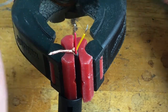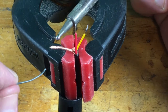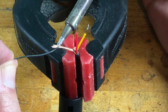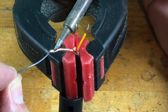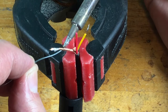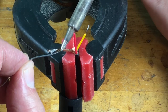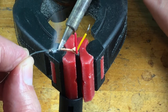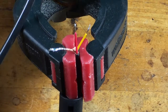There we go — that might be a little heavy, but that's all right. Then finally we'll do the ground wire. Let me clean the soldering iron up. Of course, your ground wire is going to take a little more heat, a little more coaxing, because it's bigger and a lot thicker. And we're just going to get a little solder in there. Okay, that should do the trick.